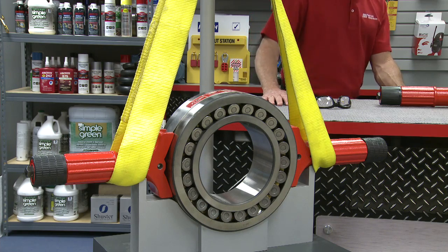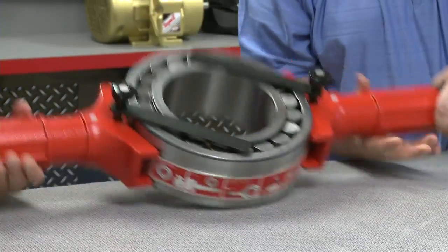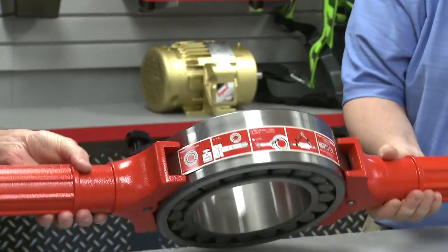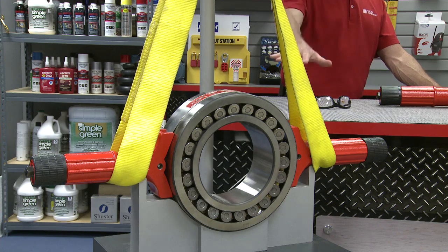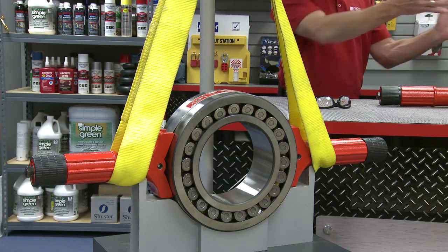Using two equal-length carrying slings that have a capacity of at least 1,000 kilograms, which corresponds to about 2,205 pounds, you can pick up this formerly unwieldy bearing and rotate it in all directions using a crane, tow motor, or other lifting device without any worries. For a 42-pound bearing you can manage more easily, but for bearings up to a ton, you would wheel it in on a crane — and that's how you would install it.